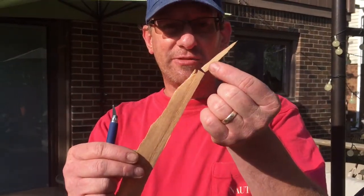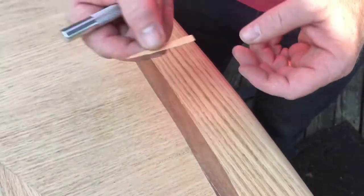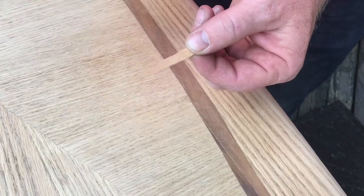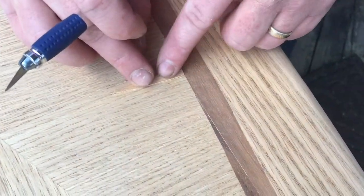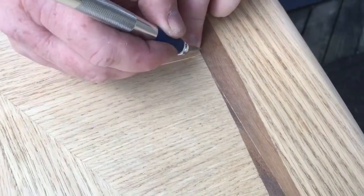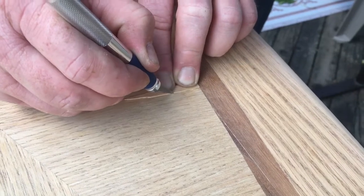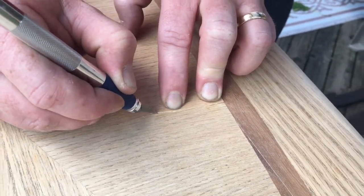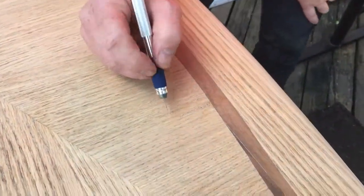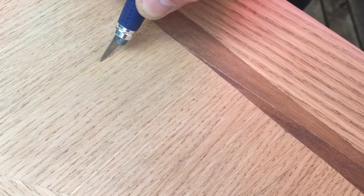I started off by cutting a piece of veneer from the scrap. I'm never going to be able to cut it exactly the same shape as the opening, so instead I cut it to a random shape - I don't want real straight lines, it'll be too noticeable. I cut it a little bit bigger than the opening, set it down on top where I want it, use it as a template, and trace right alongside the edges. That way I can cut out exactly where this new piece is gonna fit.